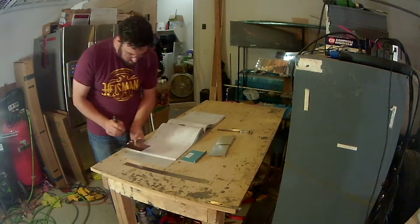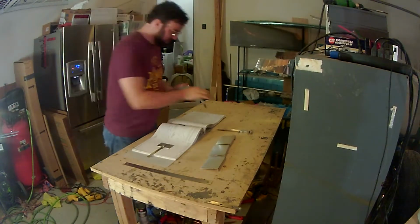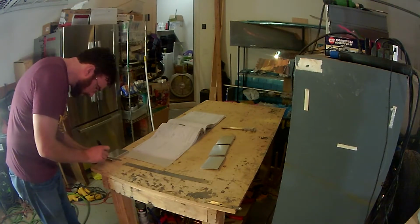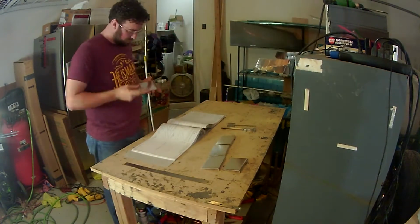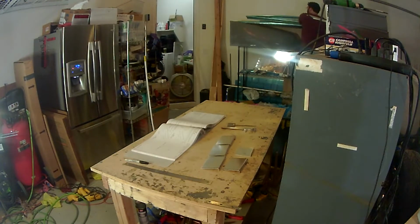The rear spar is actually not too difficult. It's got a couple doublers all along the length of it. There's a forked doubler that goes on the root end, that's a thicker piece of metal and it's stamped, so it's one of those that you have to put in a vise and straighten as best you can with a soft mallet and using the vise method.